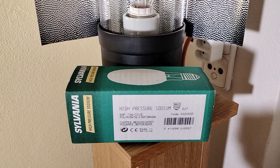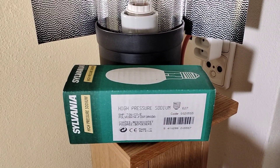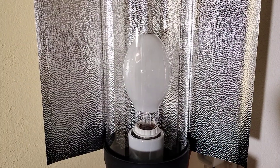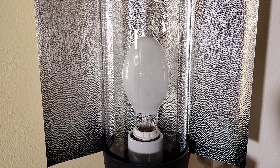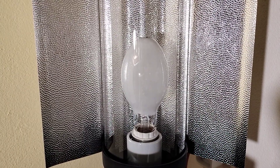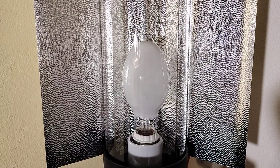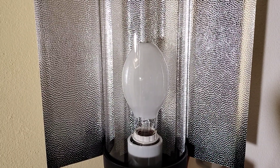This 70 watts is because this lamp has 70 watts. CO is a sign for coated, because this lamp is coated as you can see, so we will have very nice diffused light. And E is a sign for external igniter, because in this lamp we haven't any internal igniter. So when you want to use this lamp with a magnetic ballast, you will need the ballast of course, but also the external igniter. You can also use a capacitor, or use this lamp with an electronic ballast.